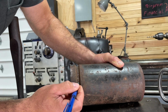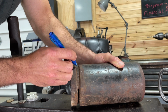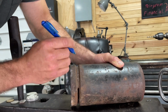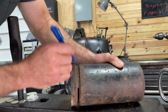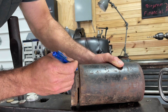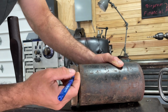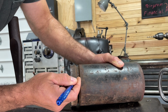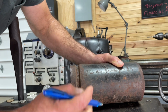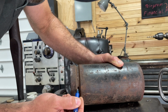Weld small. Now, on top, you're going to have to start off and step it because you're going to have to fan it out or it'll pile up too much on the top. And you don't want that. You just got to grind it off. So it kind of starts so you can flatten it out. And on the side, gravity is going to start taking over. It's going to start to come down. So that's when you tighten up and you keep it in there. Step it up. You're not trying to fill it up. You're just trying to put a hot pass in it, a legitimate hot pass. And do whatever you got to do on the bottom.